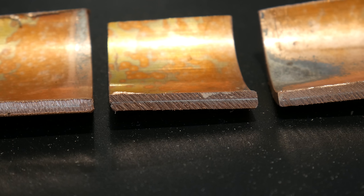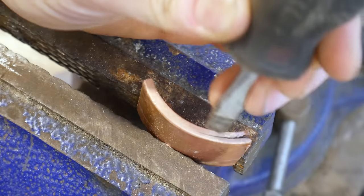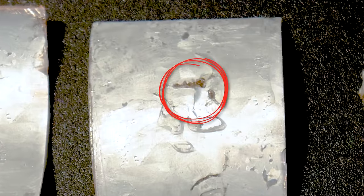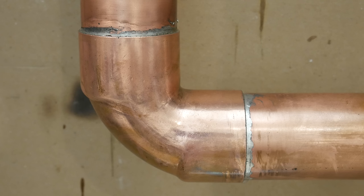As we could see, the solder reached the back of the joint around the whole joint, which is exactly what you want. But did it cover the whole entire joint? Let's open them up and check. And it did in fact cover the whole joint. Now a perfect joint doesn't exist, and we could see it right here — there are some voids but nothing major that would cause a leak. And that is how to solder a 2-inch copper joint. If you guys enjoyed this video, please give it a thumbs up, share it, and subscribe for more cool upcoming videos. Thanks for watching!